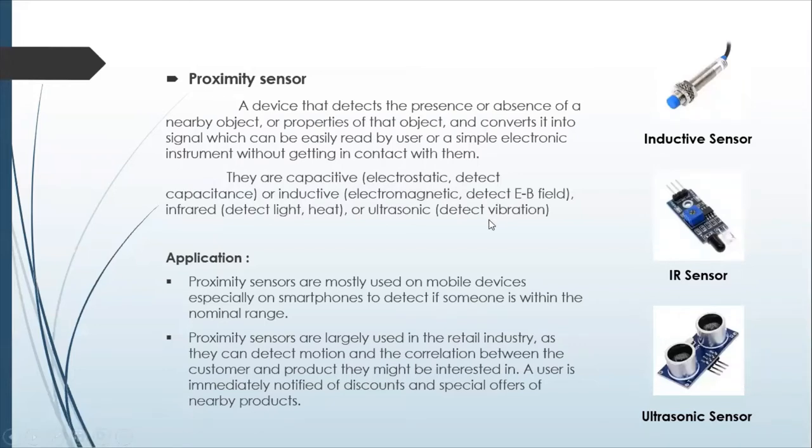Some of these are like the chimes that turn on when somebody goes through a doorway — those might use a proximity sensor. Light curtains and garage door sensors that won't close the door if somebody's standing in the way are also applications of proximity sensors. Capacitive sensors look a lot like inductive sensors, except they're usually yellow or green on the end instead of blue, and they detect change in capacitance — if something gets close, capacitance is high; if it's far away, it will be low.